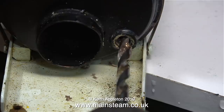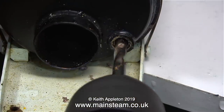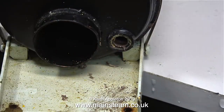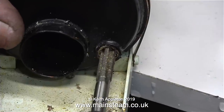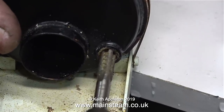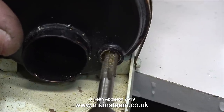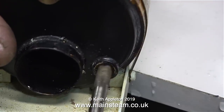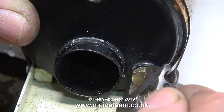But not so in this case. In the end I had to drill the bush out, making very sure that the drill goes into the hole perfectly in line with the boiler bush. After applying some lubricating oil to a taper tap I then re-thread the hole — this is more of an art than a science, you really have to feel when the tap engages with the original threads. For jobs like this, stud extractors are very useful. They're available in various sizes and are usually tapered with a left-hand thread. This method works fine if you're very careful.